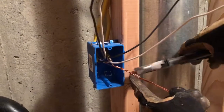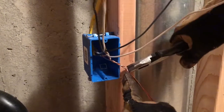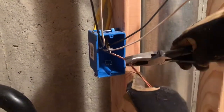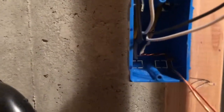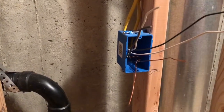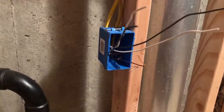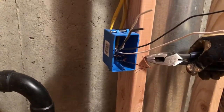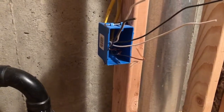What this does is it keeps it from twisting all the way back to the wires, and you get a nice tight twist. Once you've got a nice tight twist, pull it up a little bit and give it a pinch with your lineman pliers, then grab it and bend it in. This is 12-2 wire, so it's pretty thick, but you can see how nice and folded back and out of the way it is. The last thing is to take the shorter of the two and clip them off, and you're all set. That technique of pulling it to the side and twisting here gives you a nice tight twist without it reaching all the way back to the wires coming in.